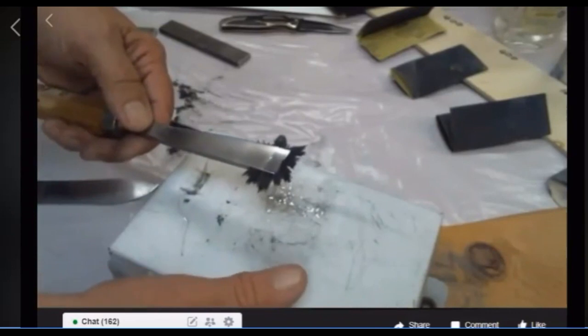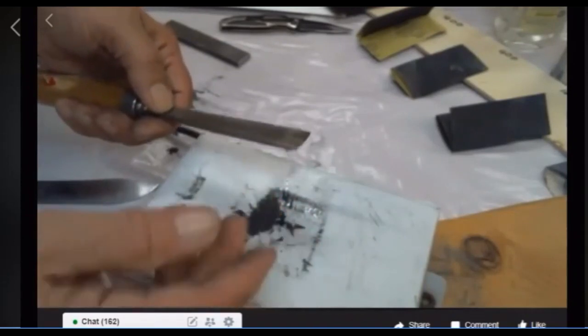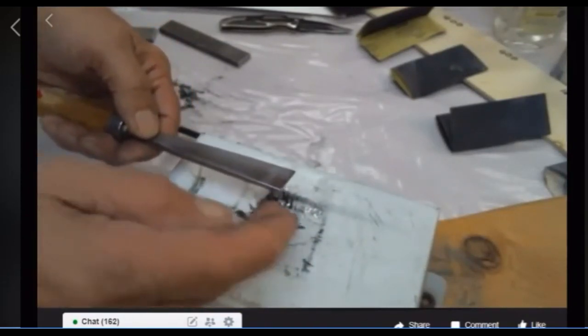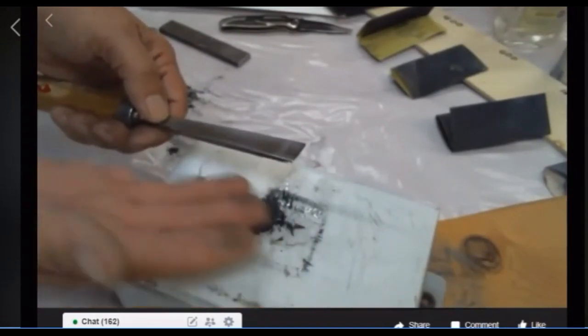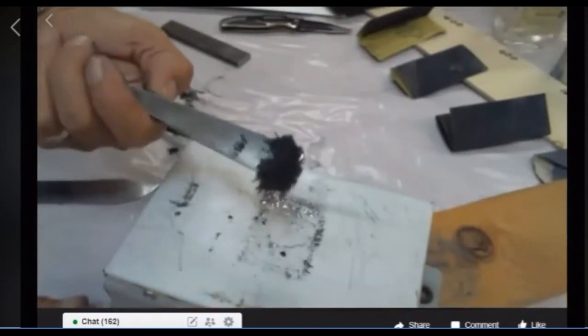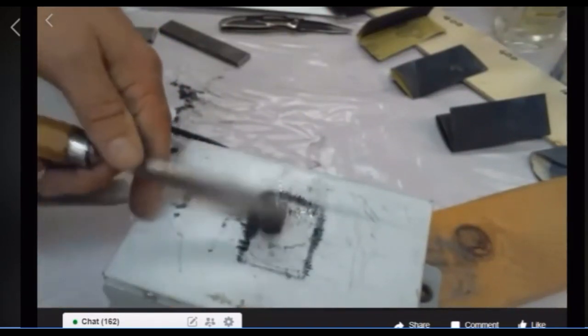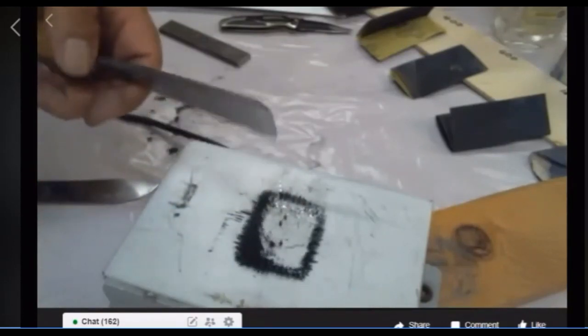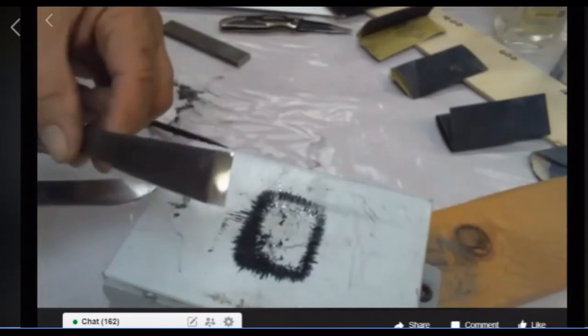To magnetize this, I left it on and then when I shut the machine off I picked it up. When it's running, you can see it's reversing the polarity — lining up the dipoles. When you stop it, the dipoles get left lined in one direction because of the alternating field. So if I stop it and pick it up, it's now a magnet. But if I pick it up while it's still running, it acts like a degausser and it's demagnetized.